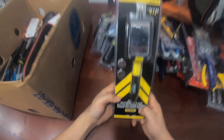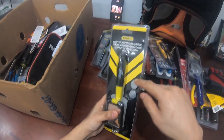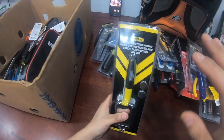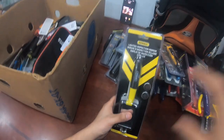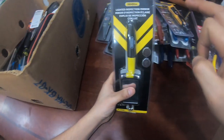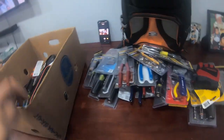An inspection mirror — you gotta be able to inspect. I like this one because it has a built-in flashlight with two lights and two batteries. Sometimes when you're brazing or soldering, before you turn the gas or water on, it's a good idea to check around the seams to make sure you don't have any cracks. Saves you time.